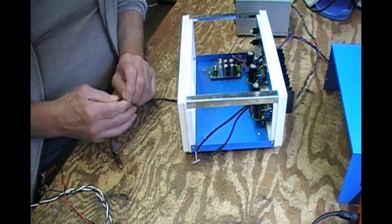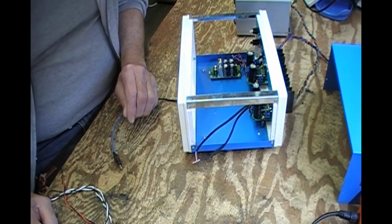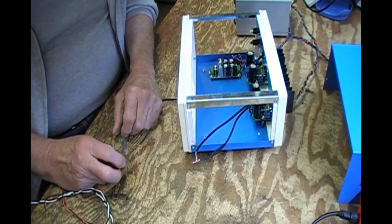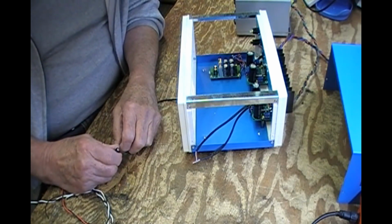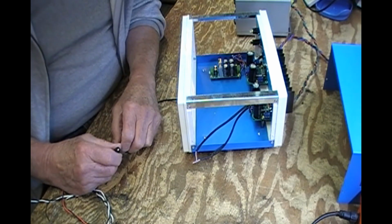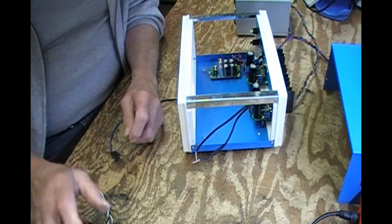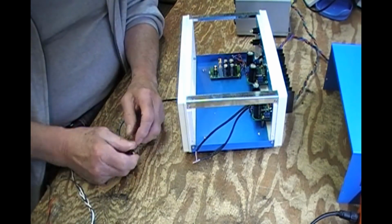I will, however, build, as I've seen others on the internet, Manuel Caldera is one who has, I think Mr. Carlson has his own version of it too, just a little box with a little speaker and a little amplifier and a test probe that's run by batteries that can either inject a signal from an oscillator or receive a signal that gets amplified and passed on to the speaker. One of the reasons why I like that as opposed to firing up this is that it's battery powered, so it's isolated. It could be used on any kind of circuits, and you don't run the risk of damaging what you're working on, or your wonderful test amplifier. So I will build that.